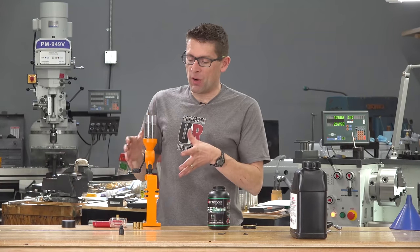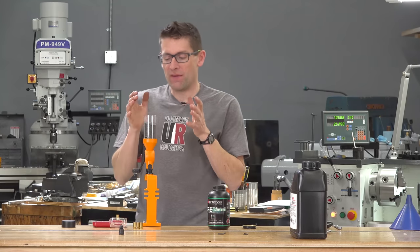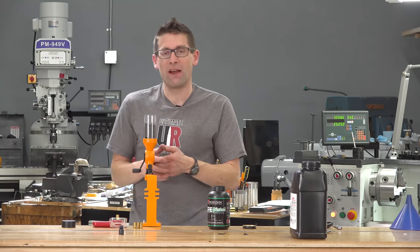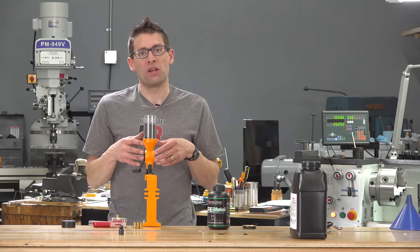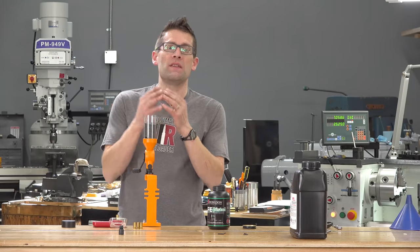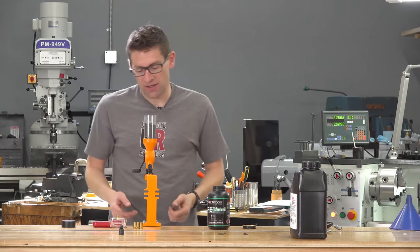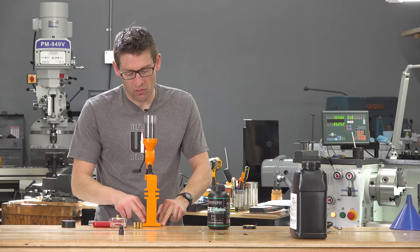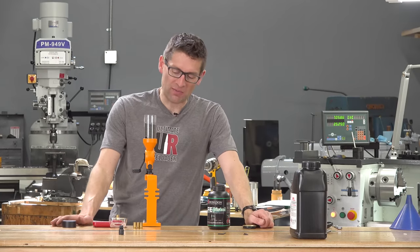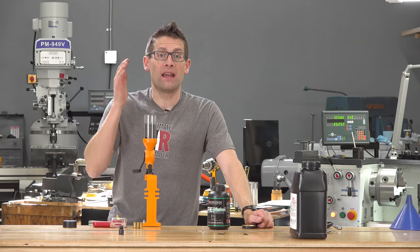This is great — I'm super happy with this powder measure. As you can see, once it settles in you're going to get really consistent charges. I love the features: I love the baffle, I love the ambidextrous handle, I love the adjustable metering insert with coarse and fine level adjustments. You don't have to take it apart to go from really small charges like six grains up to bigger charges. I'll have the full specs in the accompanying blog post — click on the first link in the video description. Love the quick detach, love how the base works, love that you can mount it to the wall or the bench. I love my slick Ultimate Reloader bench integration with these quarter-20 hold-down bolts with large bolt heads. This piece of equipment is going to get some regular use.